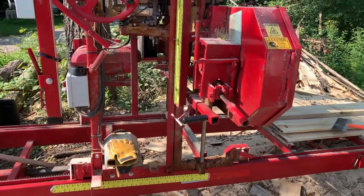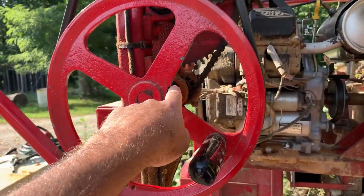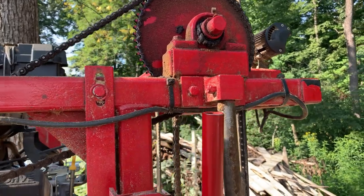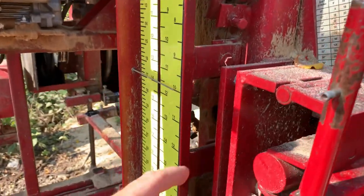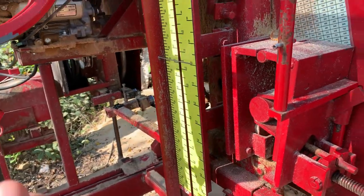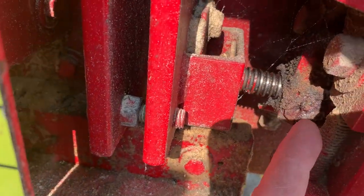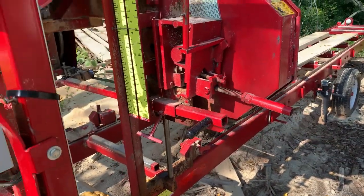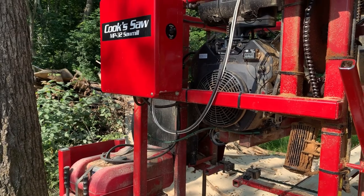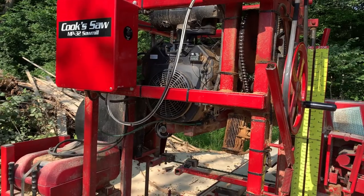So you really don't have a lot of grease points. There are two pillow block bearings in there, two on that shaft up there, and two on that shaft up there — so that's six. Then there's a grease fitting for that rod on each side, so that's eight. The drive is nine, and there's one grease fitting in here just for these threads for the adjuster — so you've got 10 grease fittings. Including the two roller guides, there are 12 grease fittings total.